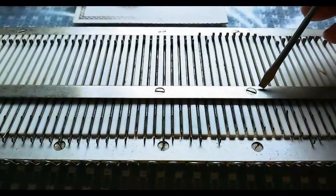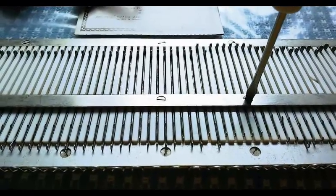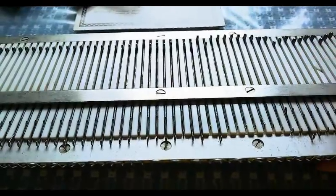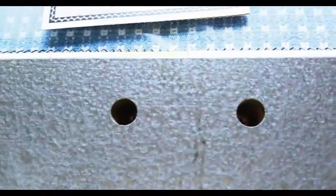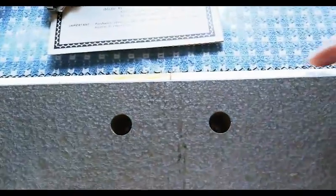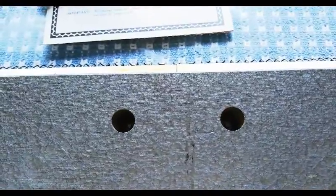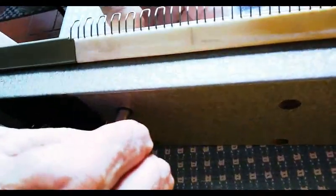Here is why Jack is so useful to have around — I'm spinning and spinning and undoing these screws and they're doing fine, but this rail is not coming off. Jack said, 'Look on the underside, there's bound to be a nut in a little port.' And voilà — the nuts are down in there on the back rail. The same thing exists on the front rail in these ports, so we'll get a little socket and get to work on those.